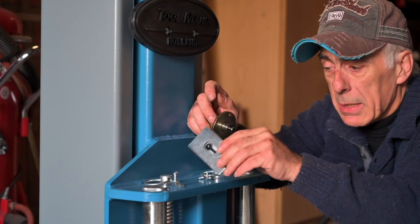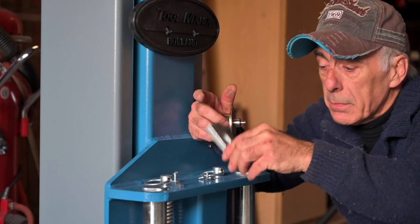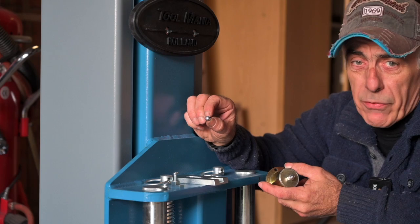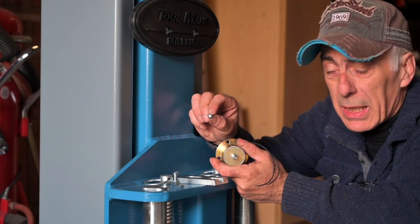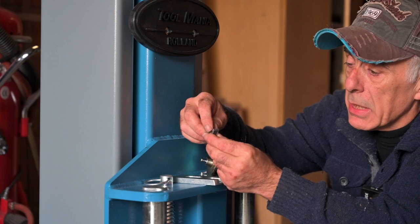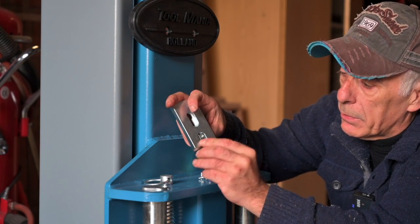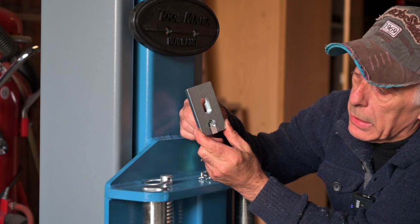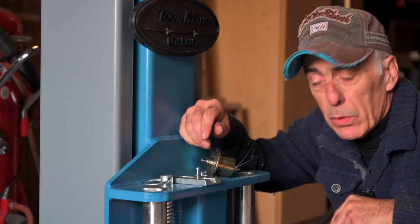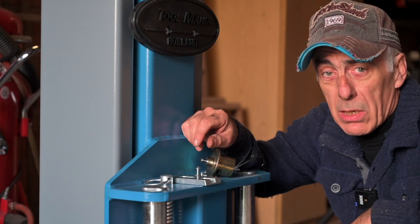The electromagnetic has to be mounted on the backside of the pillars using four short Phillips screws — use the short ones so they don't stick out inside the pillar. Make sure when you mount the metal locking plate that the cutout piece faces towards the side of the car. You will need an additional clamp element to hold the locking plate in place, fixed through the back of the column. This is your safety latch — that is also why this lift is CE certified, because other lifts don't have that mechanism.